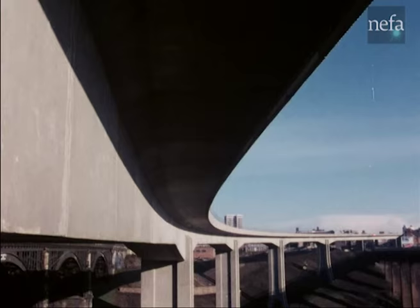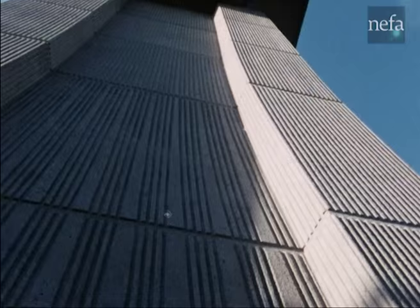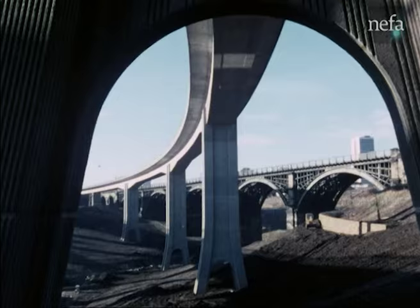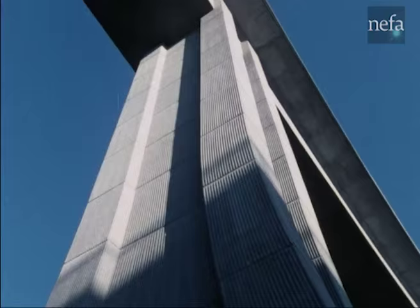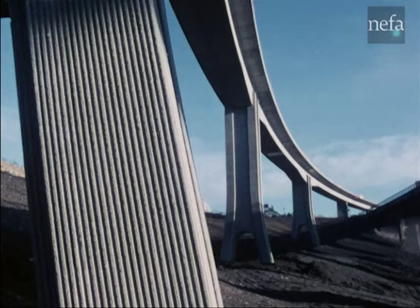Under the influence of sophisticated engineering techniques, the earliest bridge form — the beam — is once again in the forefront of bridge construction. It is felt by many that cantilever-glued segmental bridges will dominate the medium span field for some time to come. In some countries this is already true, due to the economy and essential simplicity of the method. As with many innovations, it requires painstaking engineering of the highest quality. All this has been achieved for the first time in Britain, on the Byker Viaduct.